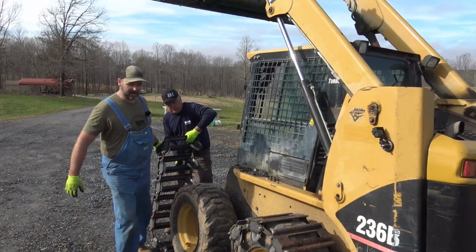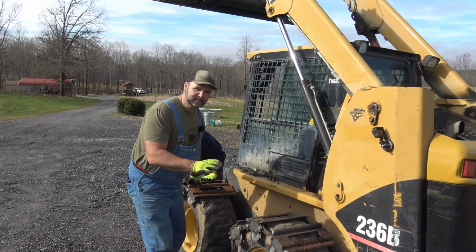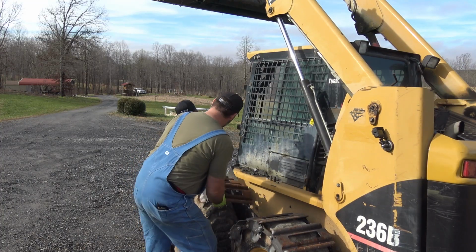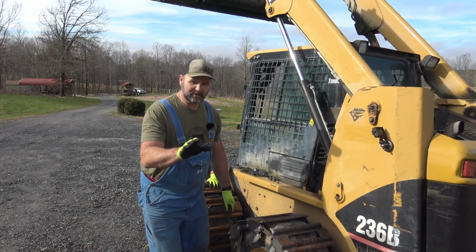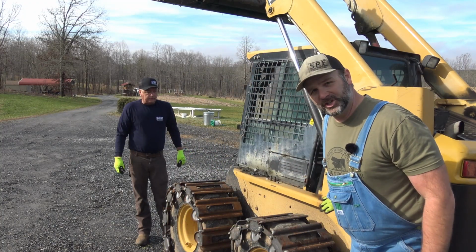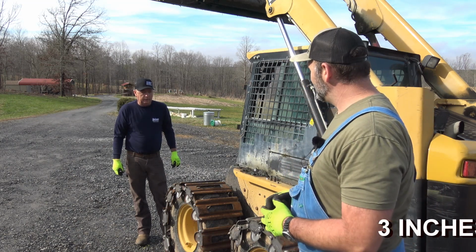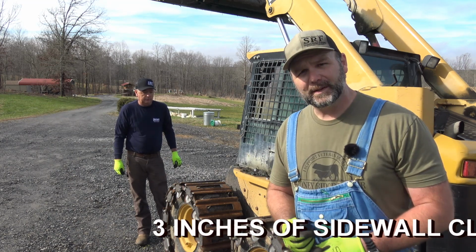Me and Cousin Vic here, throw this guy over. You've gotta have space, okay? If you look on both the Grouser website and the Trax Plus website, you need to have space between your machine and the track, okay? I think it's, what did it say, 2 inches or so? Right around 2 inches of space.